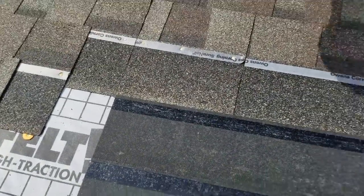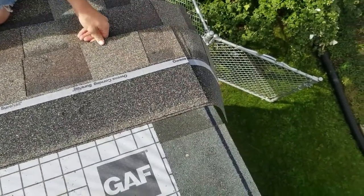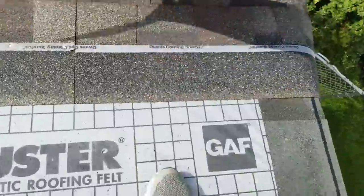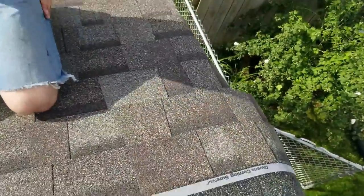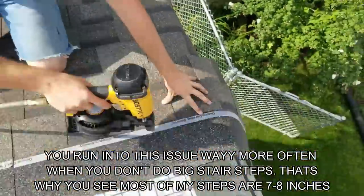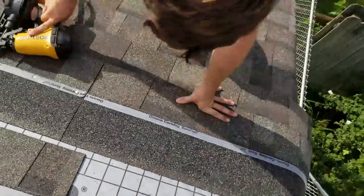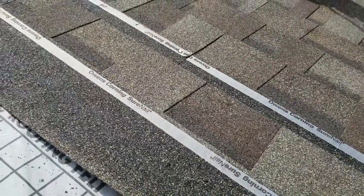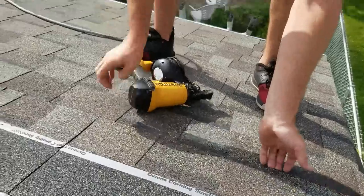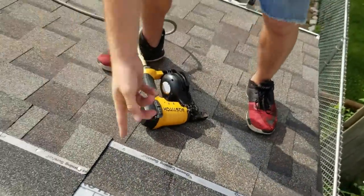Why'd you even do that? You should have tried the shingle — look how perfect that is, it lands right on the edge. You didn't even have to do all that. Maybe you did — yeah, that would have been too much, you're right. But now you know: just don't nail towards the end. Leave your furthest nail possible, then skip and nail over there so you can actually nail from the outside in on this one, then skip. Just pull it and put this one in that place — save the other for somewhere else. Don't nail right there — that's basically the goal.